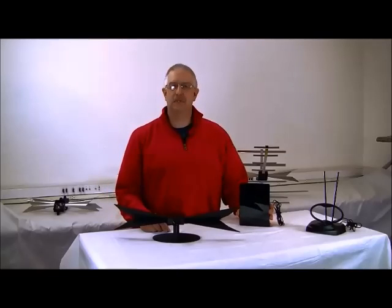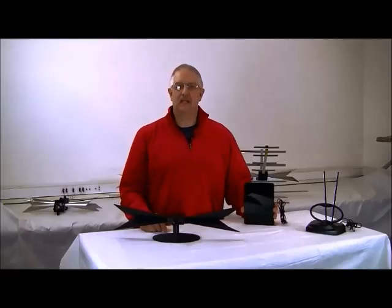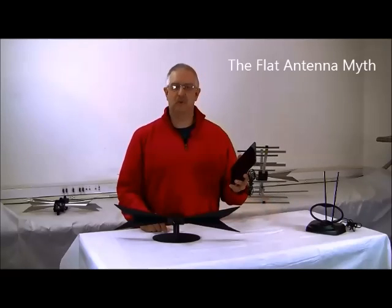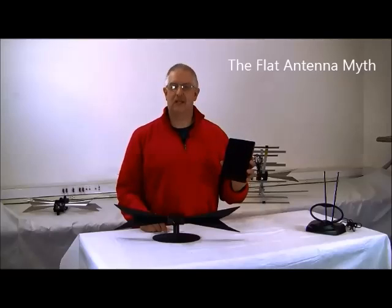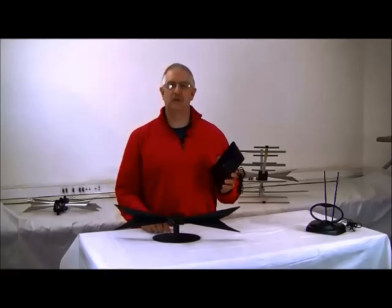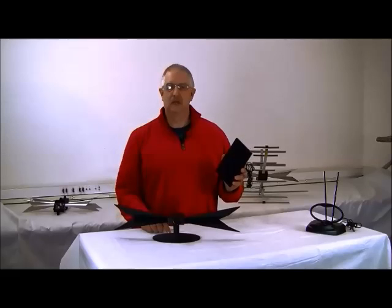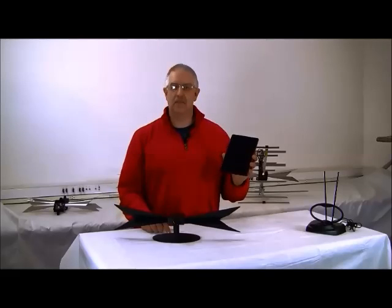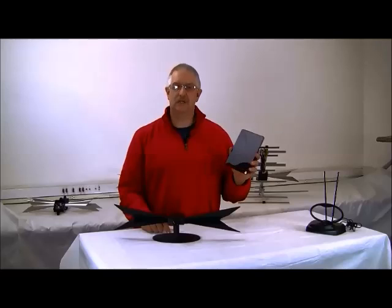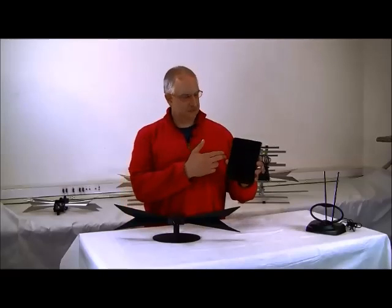This configuration results in cross-polarization and signal loss. HDTV signal reception is immediately reduced by a minimum of one half, and the antenna is highly directional, which is contrary to what is advertised. Most flat antennas are UHF only, resulting in loss of VHF channels along with poor quality UHF. The attempt to improve aesthetics compromises performance. Flat antennas are not multi-directional and require considerable directional adjustment, with capture range limited to front or back and limited to no reception to the sides.